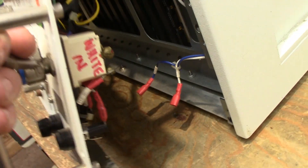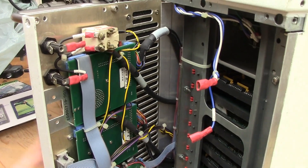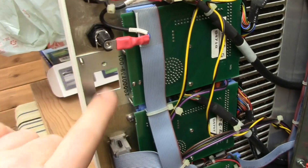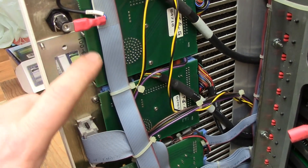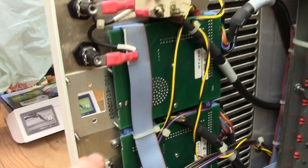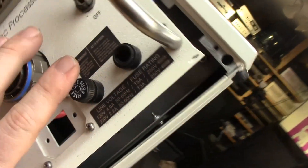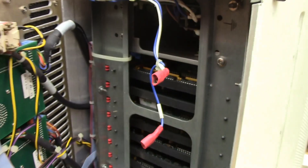I can see he's been in here. We've lost a fuse holder, we've lost a little bit of wiring, and I'm assuming that's the AC in there right now. So I'm going to attach AC power to this and we'll see what it does. Now that I have it on its side, I can twist it open a bit more. Our two fuse holders here would have connected there, and on that side of the switch it would have gone to the plug. There's an IEC connector or a square latching AC connector for this — four pins — or a DC circular connection working between 24 and 48 volts with a whole different power supply. Because this connector is square and it also says right here that this is AC, I'm fairly confident hooking up AC is correct. He's already done it, it hasn't blown up, and it doesn't smell like it's blown up.